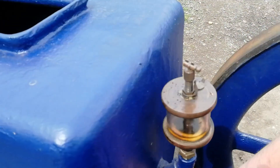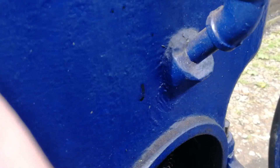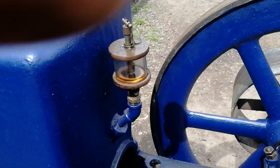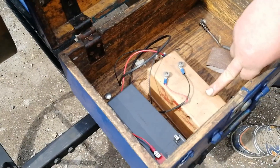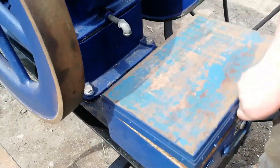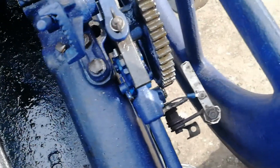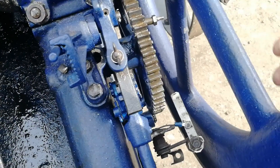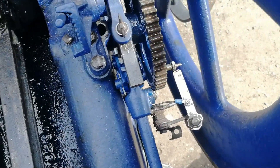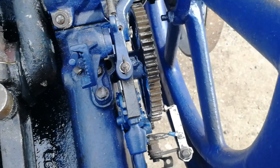The piston — fills full of oil, I think that all drips through there. There's a big old piston there, that must be seven inches across. And what runs it? These are little buzz coils that come off a Model T Ford car — connect it to a battery. It produces your spark. That as that comes across it — it comes round, catches that little pin there, so your open circuit, and then when it comes across it just touches that. And that is your spark just before top dead centre. Boom.